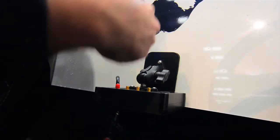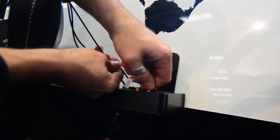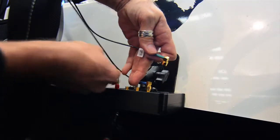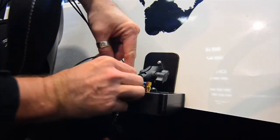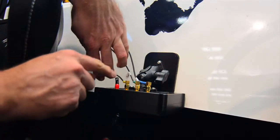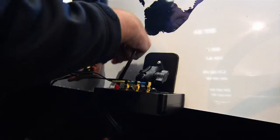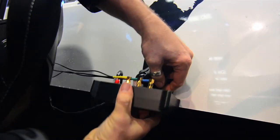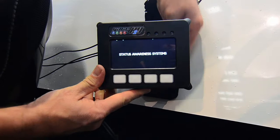The unit is connected to the mount by the adjustable knuckle. The blue connector is marked Wi-Fi and must be connected to the appropriate aerial lead. The middle green connector is marked GPS. The yellow connector is marked Iridium — it is important to note that this connector is a left-hand or reverse thread. Unless directed, the red cap GSM connector will not be used. Plug the power lead in carefully, making sure not to force pins if misaligned. Note that there may be variations of connector plugs. Once the correct position allowing maximum visibility has been found, the unit ball and clamp must be tightened firmly to minimise any form of movement in competition.